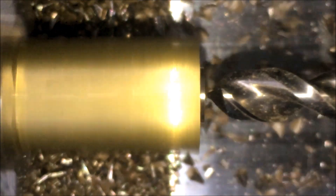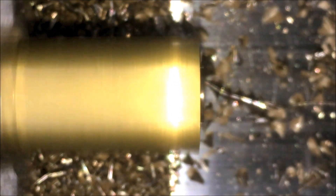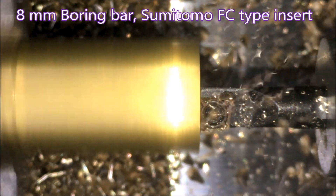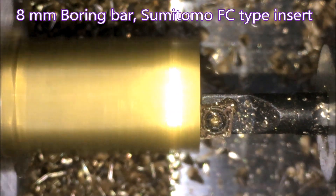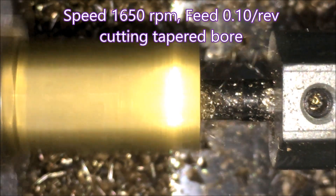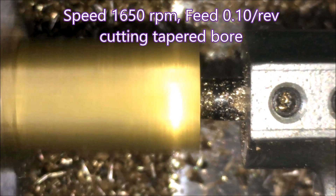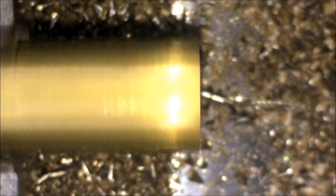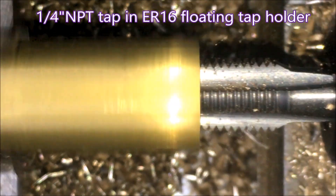CNC drills are great — they're expensive but they really work well if you've got a lot of holes to drill. This is just an eight millimeter boring bar with a Sumitomo FC type insert; they have 15 degrees of rake so they're quite good. On this low-powered machine I'm doing 1650 rpm with a feed of 0.1 per rev.